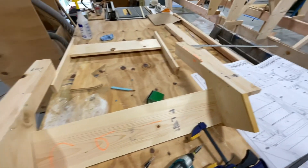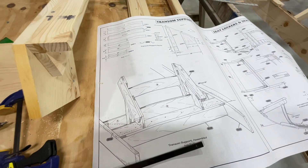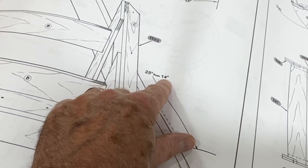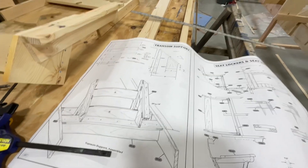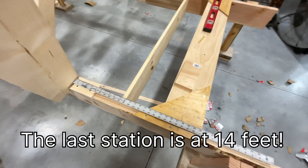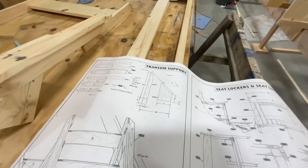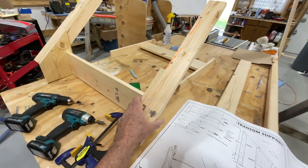For the most part you just cut out the pieces, and then start assembling it to make it look like this. One thing that has absolutely been perplexing me is this measurement — '25 inches from 14 inches.' It's a typo; that's supposed to be from 14 feet. I just now figured that out. What that means is that the back edge of this needs to be 25 inches, which it is. I've just been so puzzled by that. Other important things: it's a 43 degree angle here.